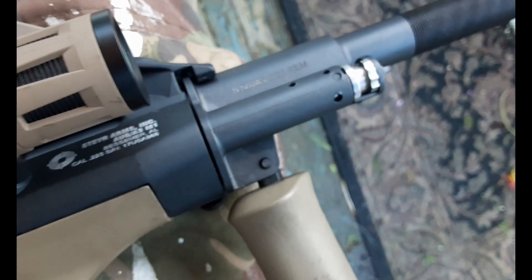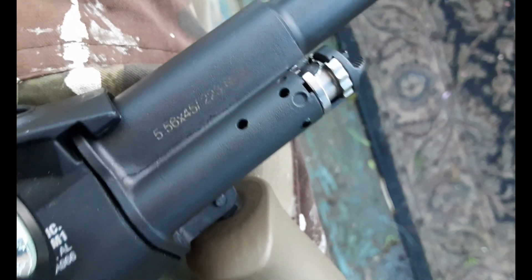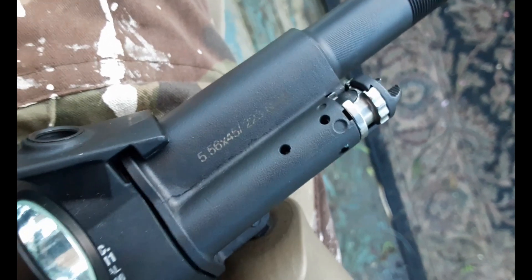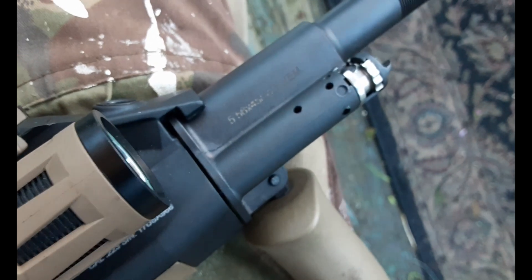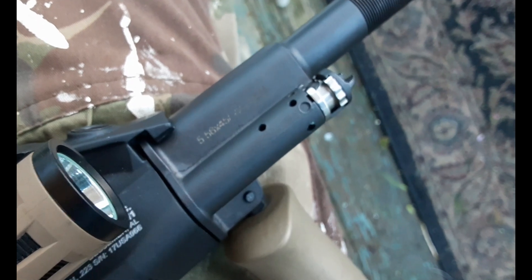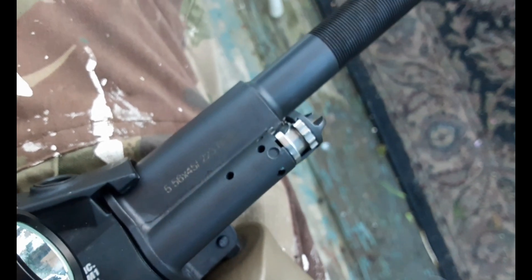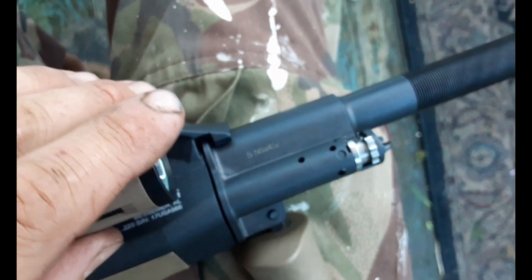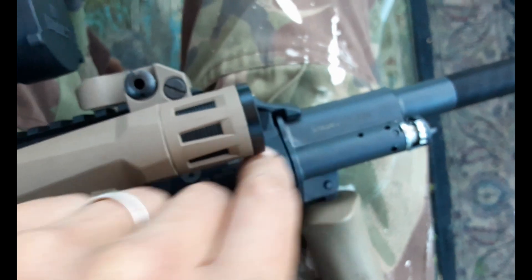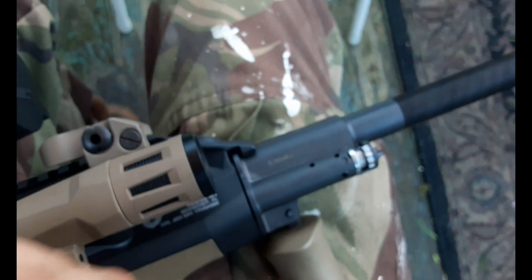The normal position is for regular cycling in normal conditions where the rifle isn't clogged with dirt or debris — just normal semi-automatic fire. The adverse position is for when the rifle is clogged with debris or you're using ammunition with less powder and you need it to cycle properly in those conditions. The grenade position does not allow any cycling because, historically, certain rifle attachments required the rifle to be single-action in order to launch a heavy grenade projectile loaded into the barrel. That projectile is much heavier than a bullet, so you need maximum force. Grenade mode blocks any gas from entering the piston that would normally push back the bolt spring and cycle the bolt — all the power is concentrated straight through the barrel.